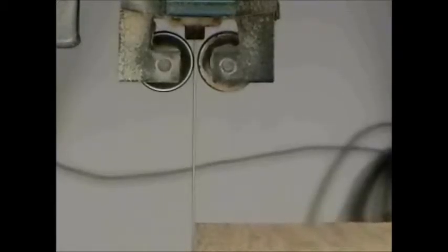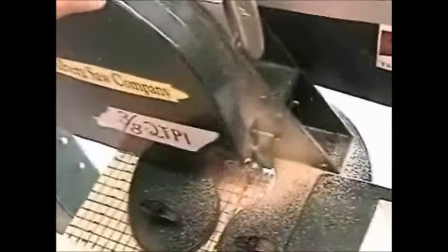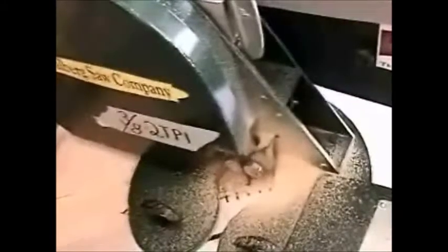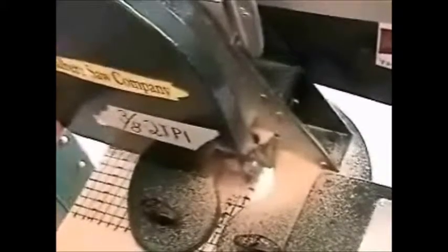The second video clip here was taken with the Fahlberg saw cam. It shows the same piece of Doug Fir and the same 15 inch cut depth, but instead of a rip cut, we're going to cut a plug to see how tight we can twist the blade into a radius. The blade is 3 eighths, 2 tooth per inch, with a wide set. This is where you really do need blade guides — there's no forward motion here at all. It's just a hard twist, and you can hear these guide bearings scream as they take the full force of the twisting action. The guide bearings are set at the same wide gap as we used for the last rip video clip.